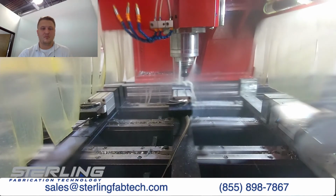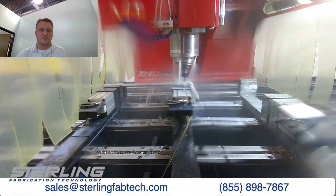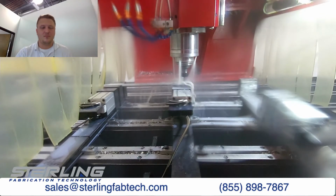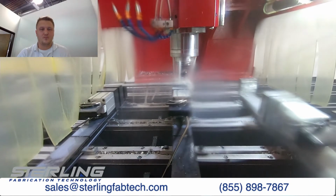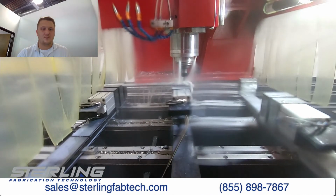Once that whole process is done, I can get my G-code program out of Mastercam and put it on a flash drive and bring it out here to the machine, but we're not quite ready to run it yet. I've got my program ready, but then it's my fixturing. First of all, what kind of fixturing am I going to be using? Am I going to be using my Kurt vices?